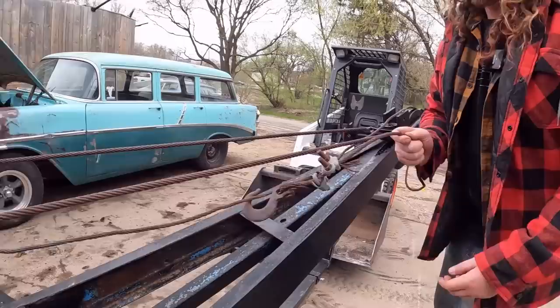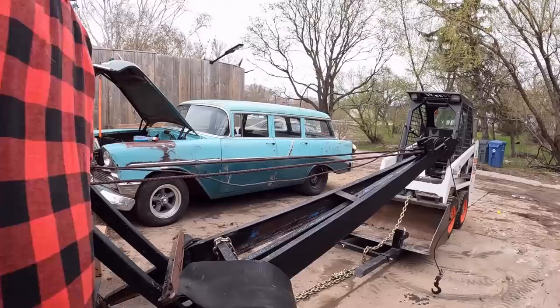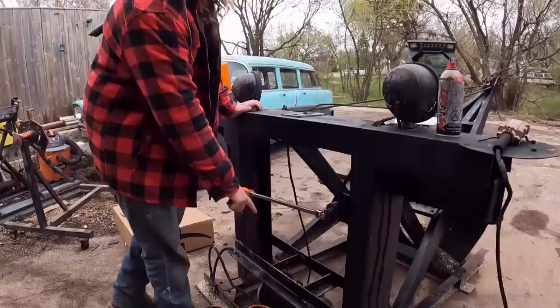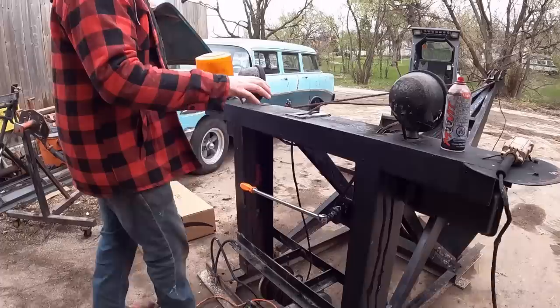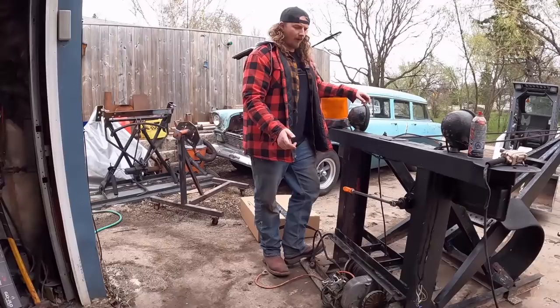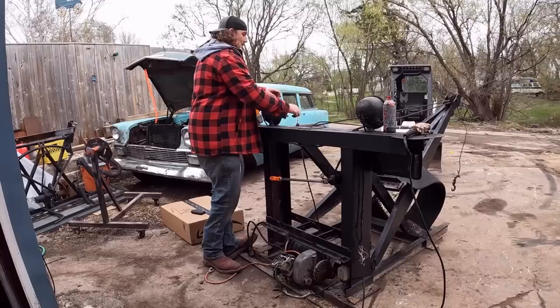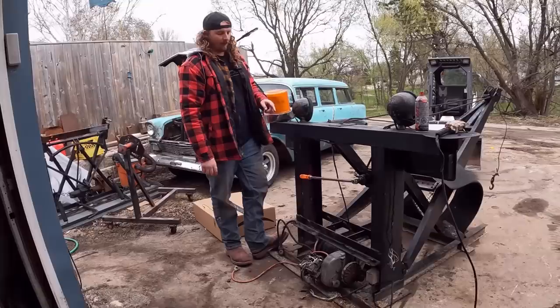That sets your up-and-down angle. Then you have your winch cable - this is some pieced-together stuff but it'll hook onto your sling with J-hooks and chains to lift it up. It runs all the way through and has a pulley that runs down, with the winch on the bottom. This winch looks like it's mounted upside down but that's kind of irrelevant. I've also seen guys put the winch right up top and let it rip. You could just bolt an 8,000-pound winch right to the top, straight back down, recable the sides, and honestly be done.